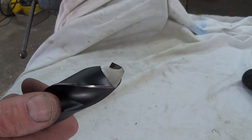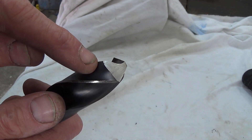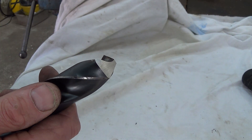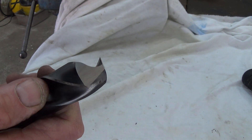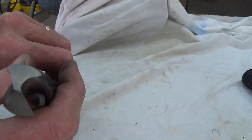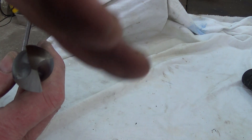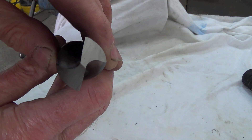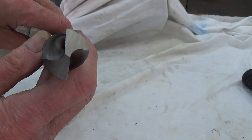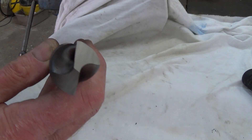The real question at the end of all this is: does it work? Well, the answer is it does. You can see the rake angle cut equally on both sides, and the clean faces with a nice bright front edge on both sides. You can also see that the chisel is down at 45 degrees, which is the correct configuration for the drill. I'll show you the 14mm as well — it's just the same.